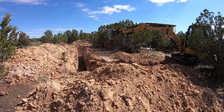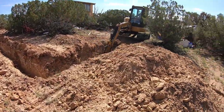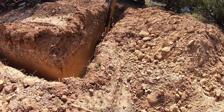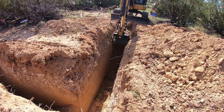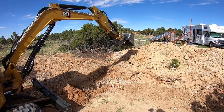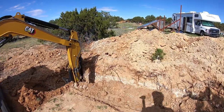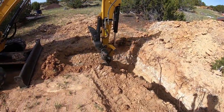What they recommend is at least 100 feet — the more the better. I'm putting in approximately 150 to 175 feet. I bought four-inch thin-walled PVC piping. At Home Depot they had a bunch that were damaged and gave it to me 50% off, so that was the cheapest option. Each 10-foot section of the four-inch diameter thin-walled PVC piping was approximately $21 at Home Depot. That gives plenty of time for the air, when pushed through the tubing by the fan, to acclimate to the ground temperature.